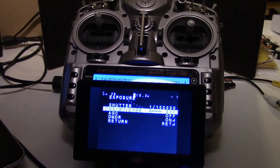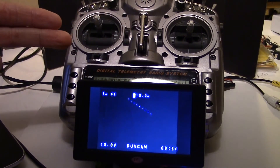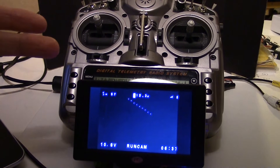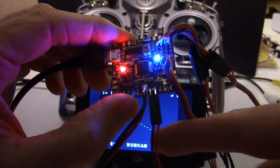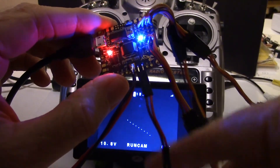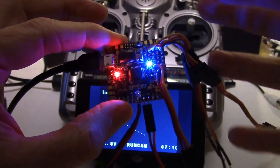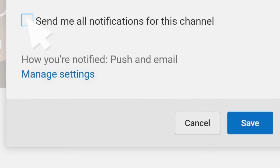RunCam has or will have instructions on their site on how to do it. As you can see, I didn't do anything to the radio as far as settings, and all I did in Betaflight was go to the ports tab and set the RunCam device on serial port 3 — that was it. The hardest part was just hooking up the wiring: TX going to RX and RX going to TX. If you just remember that, that should be it. The rest is just standard setup for an FPV camera. RunCam is coming out with a lot of new products lately and I'll be doing more videos on those to keep you up to date. Don't forget to like and subscribe and hit that notify checkbox. I'll talk to you later.